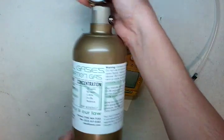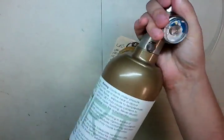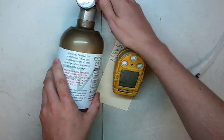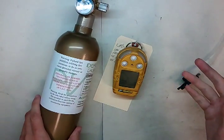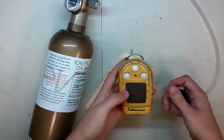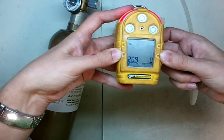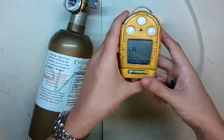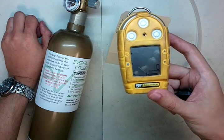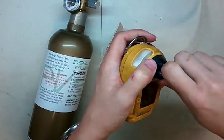Open the regulator up. Plug it into the monitor. You might be saying we don't have H2S cal gas on site, or we don't have MSA cal gas on site — that's okay. If you have any other cal gas, you could even buy from a gas blending manufacturer like a 25% LEL methane or a 29% LEL methane mix — those will both work just fine. A lot of people have MSA gas, so you might know somebody with an MSA cylinder sitting around. Or you can send it to me — shoot me an email at james@idealcalibrations.com. Hold the bottom two buttons to send it into zero mode. Sometimes you have to start off a bit lower than 29% LEL — sometimes you have to start at about 13.